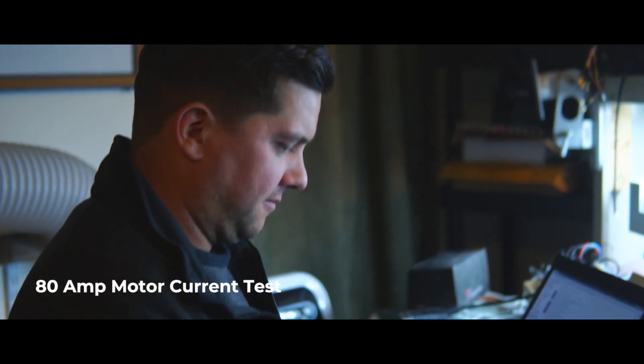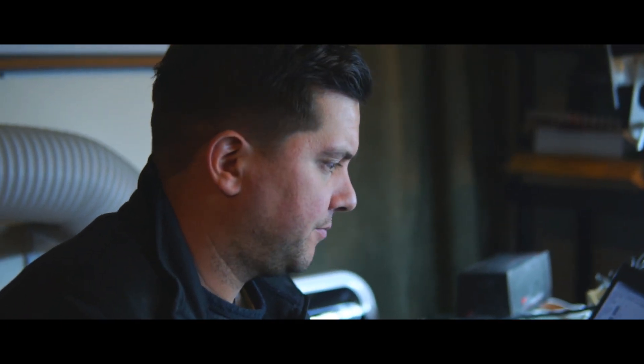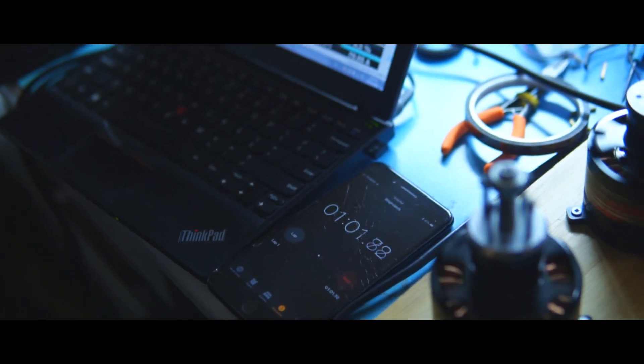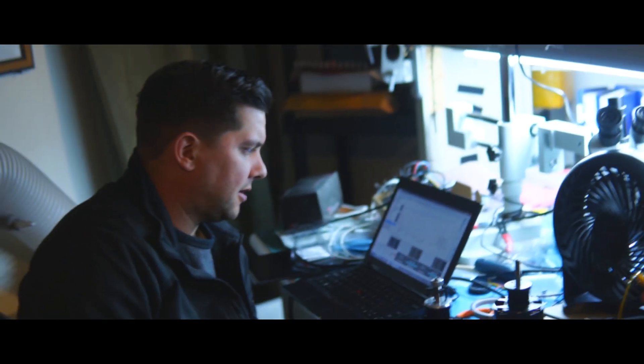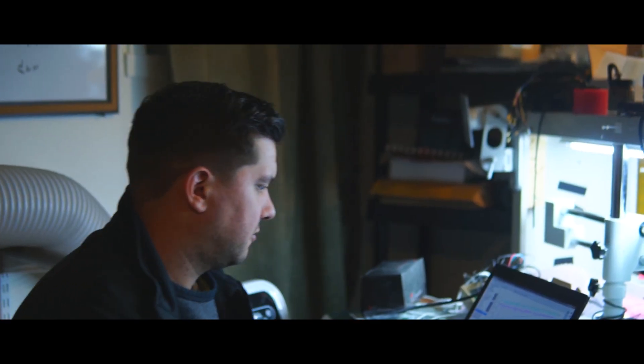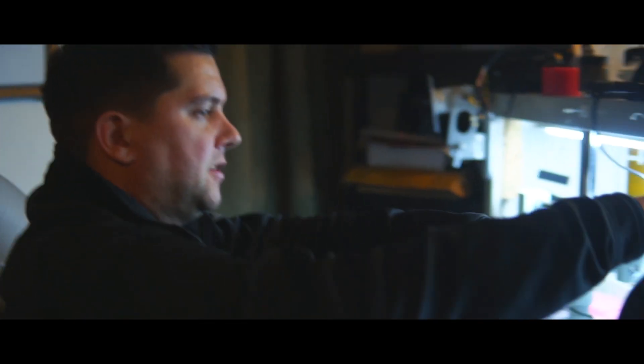Third time is a charm. This is a thermal test — 80 amps open loop. We're just seeing how long the Unity could sustain 80 amps. Previously it was 90 seconds, so we're expecting about the same from this unit here. We're almost hitting the minute mark and we're still at 80 amps. One minute. As soon as one starts to throttle I'll cut it. One minute and 20 seconds — Motor 1 took a little longer. Let's cool this down.